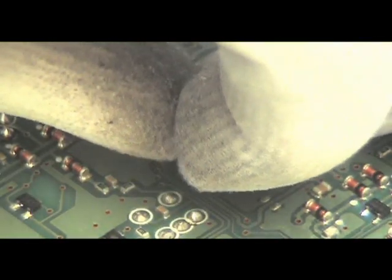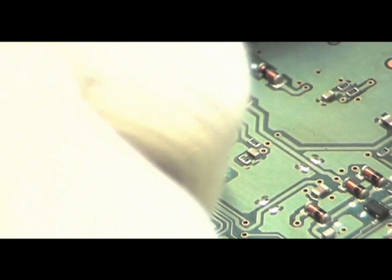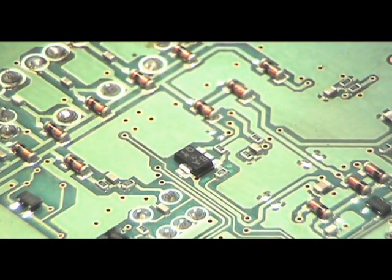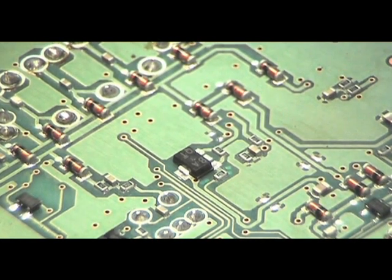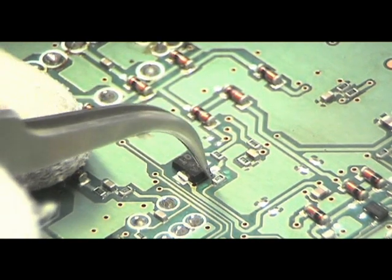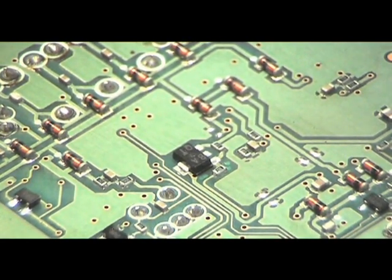Where's the device? Now I'm going to solder this in with a conventional soldering iron. Normally I would use a solder paste and the hot air, but if I can get away with it I'd prefer to use an iron. The reason being is it is quite tricky using a hot air rework station. I'm quite a dab hand at it but if I can use an iron I always will.